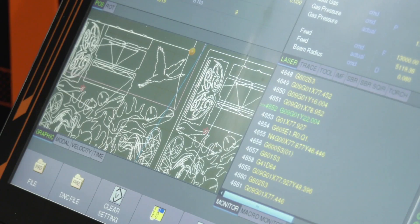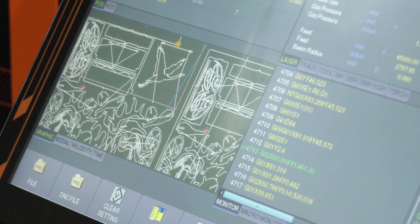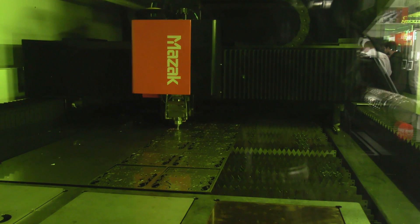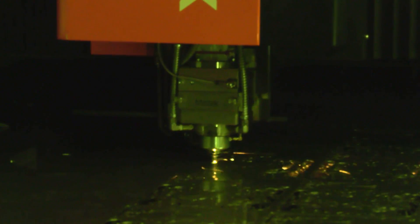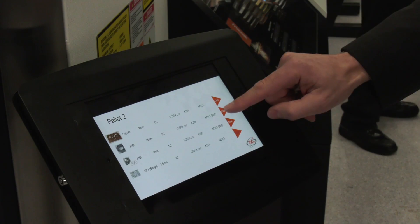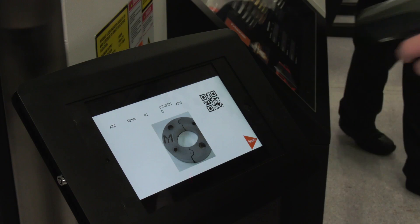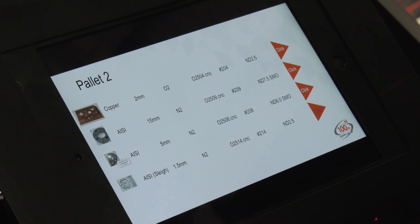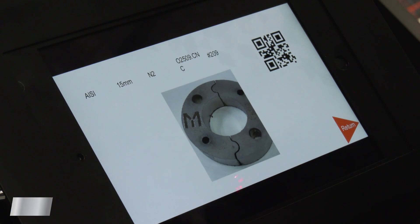There are new features to aid cut quality and make it easy for the operator to monitor the temperature stability of the torch. One of the main benefits is that this machine is now 15% quicker than the previous generation, and it now has 10 kilowatts — giving very thick cut capacity up to 35 millimetres in many materials. There's also a QR code: customers today can simply choose the material they'd like to run from about 20 different material types and thicknesses, scan the barcode and press go — truly de-skilling the operation.